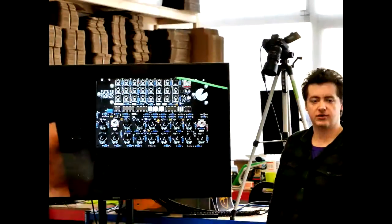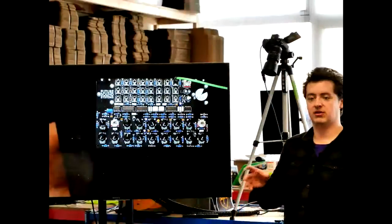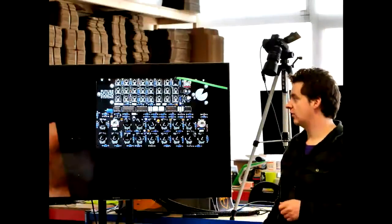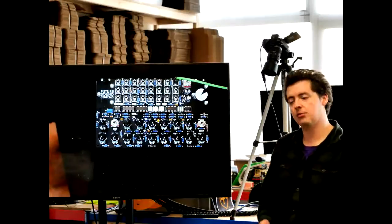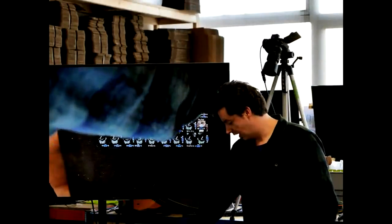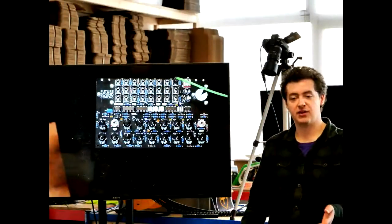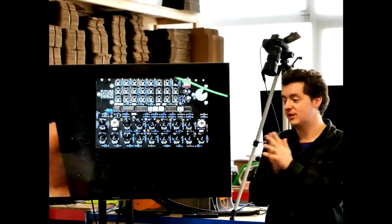You can plug things into this synth — if you've got a Eurorack system it'll play happily with this. You can send external audio through the filter, though you may need a preamp stage to drive it hot enough. The VCA is also happy being controlled by external signals. Does anyone have questions from the intro?